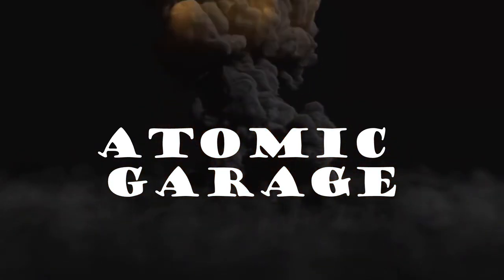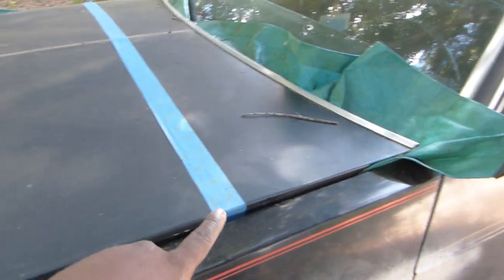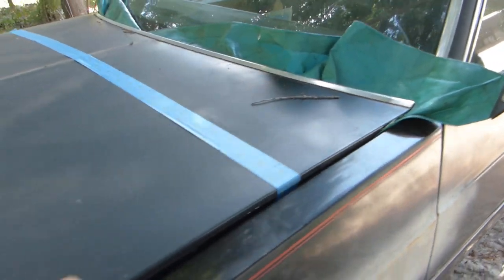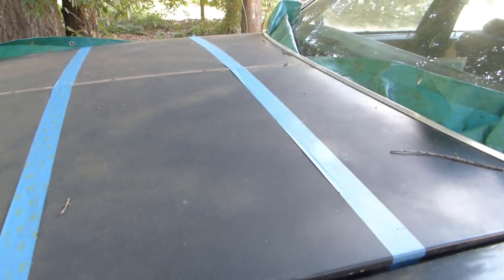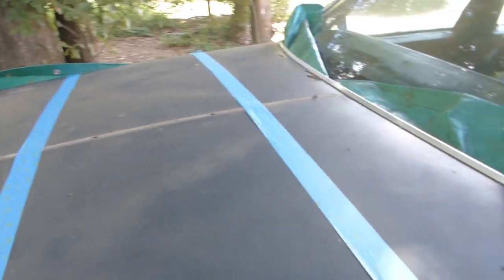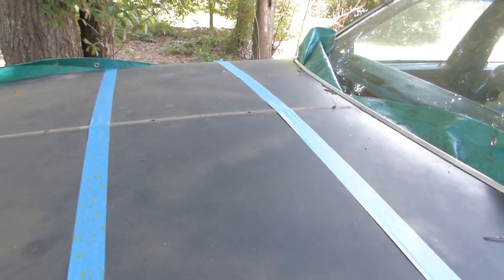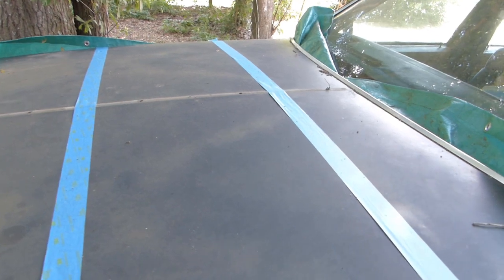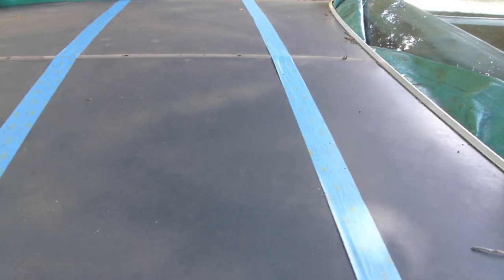Come on, take a look at what I've done so far. As you can see right here, I've got these two tape lines, and I still need to measure from the corner of the hood to make sure it's level. If you look closely, I've already scribed this circle, which is the actual diameter of the air cleaner I'm using. I'm going to go a little bit further out from that. I didn't want to cut a huge gaping hole — I want to do as little cutting as possible while still getting some airflow in. We'll start with the angle grinder and then take over with the sawzall, get some cuts going after we do the measuring, and see if we can get that hood to shut.